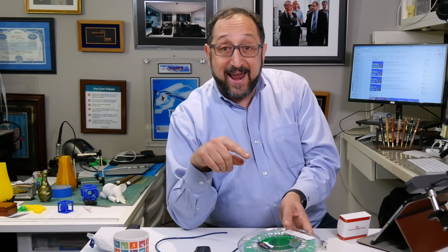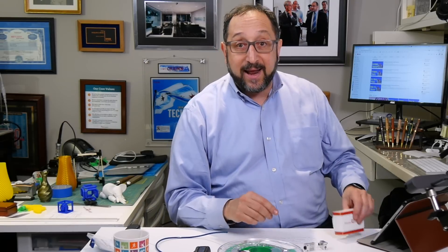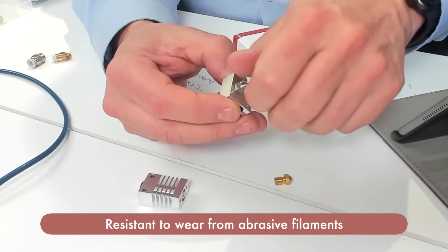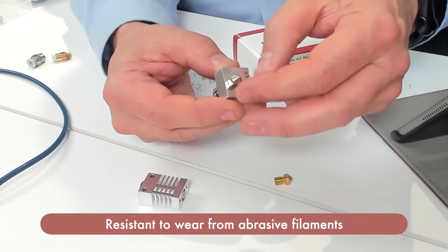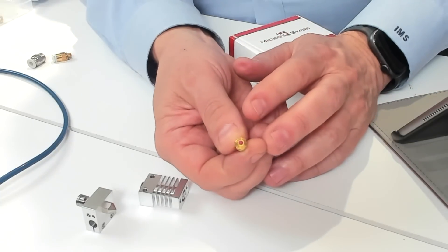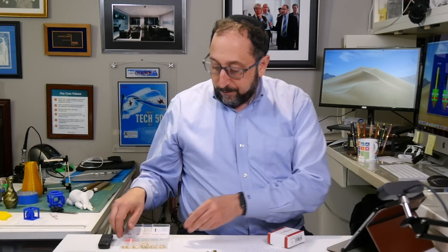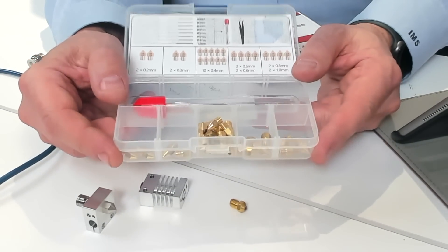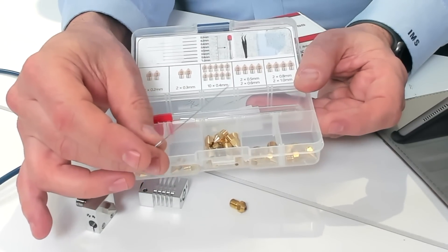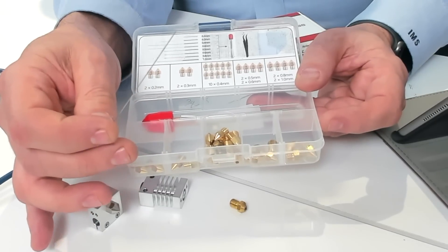Let's take a look at that hot end diagram in a bit more detail, and then we'll look at an actual hot end made by Micro-Swiss that I will be putting into my Ender 5 in the next couple of weeks. At the bottom of the hot end you have a nozzle. This is a brass nozzle coated with a special material to make it more resistant — in this particular case, we have a ruby tip on our brass nozzle. They also make wear-resistant all-steel nozzles. Most people use brass nozzles because they conduct heat very well, and you can buy a whole assortment of them inexpensively. To give you an idea of what a 0.4 millimeter nozzle looks like, this pin here is 0.4 millimeters, so you can see the size of the filament extrusion that would come from this nozzle.